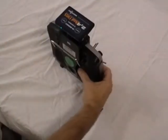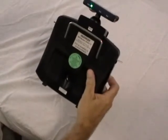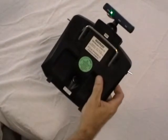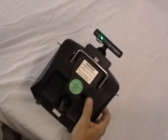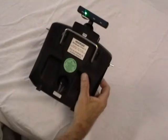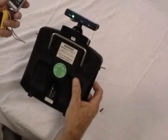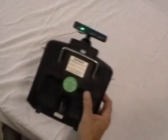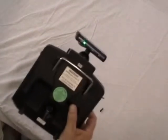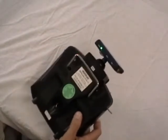A quick check of the manual - always helps. The error light was telling me I'm swamping the signal by having the receiver powered up too close to the transmitter. They recommend being a half meter apart. Once I did that, I've got solid green lights on both the receiver and the transmitter. As you can see, if I pull them together it swaps the signal, but as soon as you pull them apart you get a solid signal. Everything's working properly.